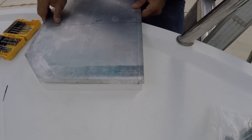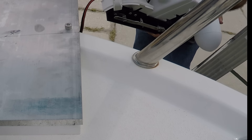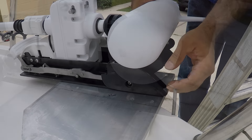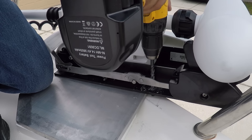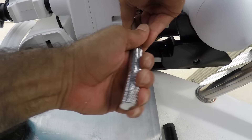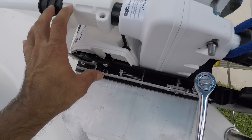That's where the bolt is going to be resting right here. So now what I have to do is get the Minn Kota up here and widen the base so I can get that bolt through there. Now I'm in the pilot house and I'm going to go right through here to the anchor locker. I'm putting this bolt right here temporarily and I'm going to put two on the other side. Once I have it secured I'm going to try that motor going up and down.